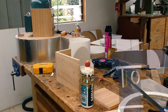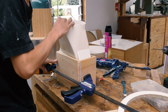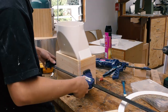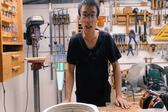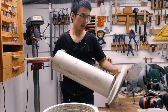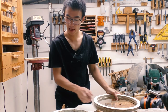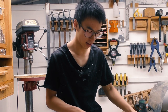So much to do in terms of assembling the blower. It was pretty much done, so here I'm starting on the cone — the actual separation bit — and building a shroud. I had a bit of a change of plans regarding the design of the cyclone body: I made it bigger because the original size was too small. It's now almost as tall as me. I also made the cone a little bit more aggressive — or rather less deep.